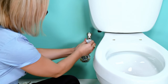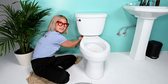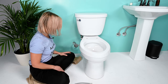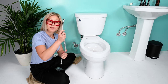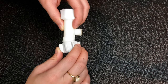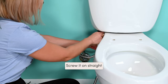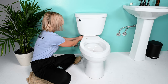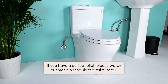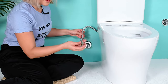Make sure it's straight and start connecting to the tank. With all of these steps, use only your fingers to tighten because you can over-tighten and damage your plumbing. Use a wrench only if needed, and use caution. Now grab your steel flexible hose from your TUSHY kit. Make sure it's not mis-threaded — if the connection only turns once or twice, back up and screw it on straight. If you have a skirted toilet without access to your water supply, check out the skirted toilet installation video for how to use a 3/8-inch adapter.